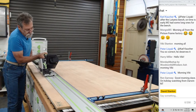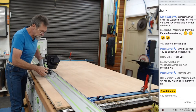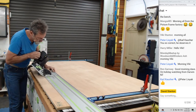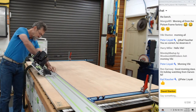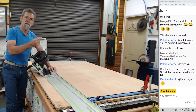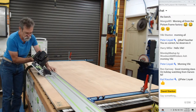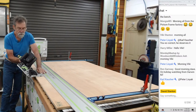All right, the saw. I'm going to flip over to 45 degrees. If you don't have a table saw, get yourself something like this. Yeah, 45 is there. And on the back, lock that as well. I've got a Bluetooth battery in here, so I've connected it to the dust extractor so it'll turn on automatically. And the depth I want to go to, I will just check first before I actually run it. I'm not going to turn the saw on.